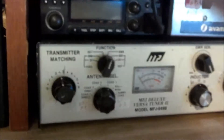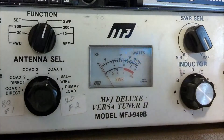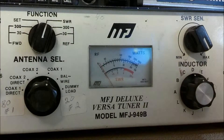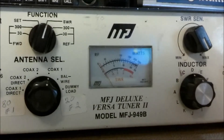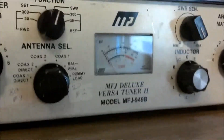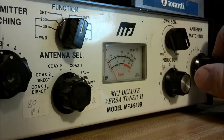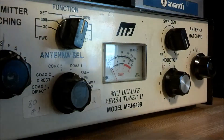I'm going to switch to SWR - this needle is going to measure how much reflected power is coming back. So let's see: if I whistle here, the needle doesn't move, so that's a good thing. I'm going to turn my power up a little bit more on the transceiver. Nothing moving there - that's a good sign. I can see the needle moving a little bit, so that's going to tell me there's a little bit of power coming back. I'm going to adjust my antenna match and transmitter match to get that needle down to zero while I whistle.